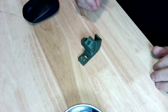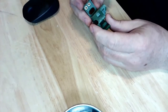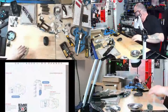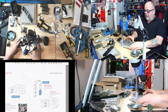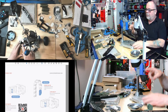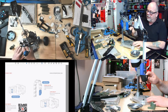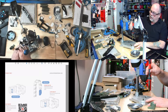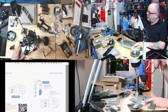Adafruit heat inserts jig comes in handy with Voron builds. Yeah, somebody local here showed me a make they did one time. I'll pop it up here. I have this little thing here. It's actually like a drill press thing for your Dremel. Sorry, it's a Dremel drill press basically. And there's an adapter, I've got to find the file, that you can print for your soldering iron. And just imagine, your soldering iron with the heat insert tip is on there.